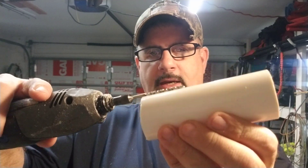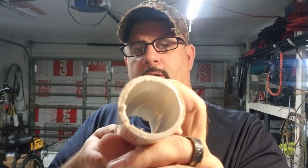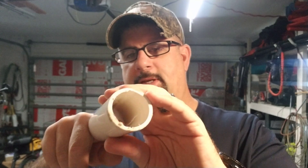This worked out really well and I just wanted to share a tip and trick with you. This is just a regular drill bit that I put on the Dremel. As you can see it's not long enough — the cutting edge doesn't reach all the way through this piece of pipe. So you've got to work it in there and flip it around and go from the other side. The trick is getting that line straight, and then I followed it up with a straight file and just got into that groove and worked it back and forth.